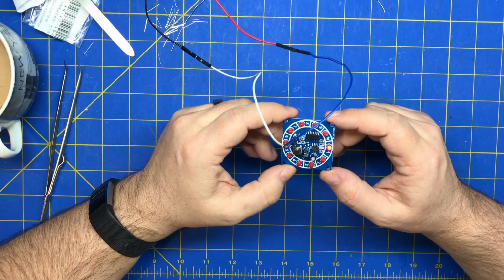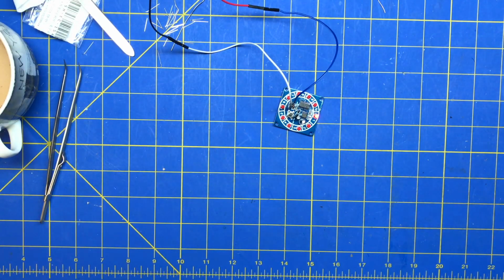So how do we troubleshoot this? Well, let's double check what the voltage needs to be. We'll do an LED Roulette kit image search. You just put a 9-volt battery, it looks like. Maybe I just need more voltage. I mean, this could be TTL. TTL can go up to, what, 12 volts? All right, so we'll bring this up to 5 volts.